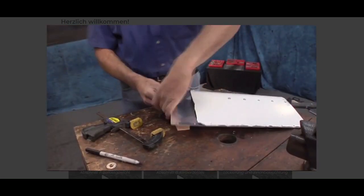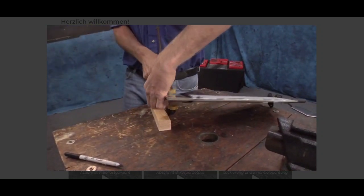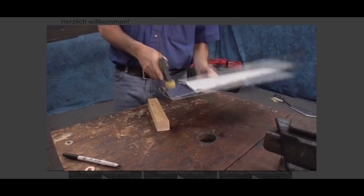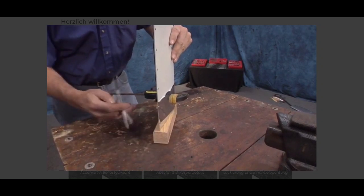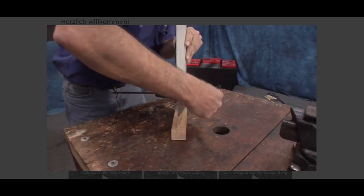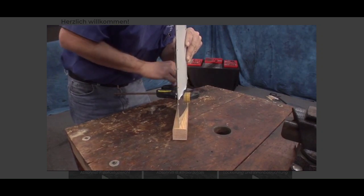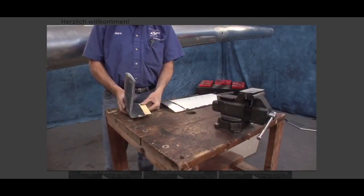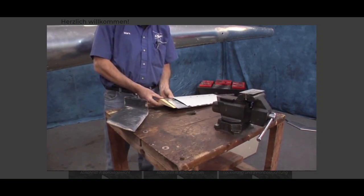Insert a short piece of 7/8 inch diameter tubing or use a socket that is 7/8 inches in outside diameter in the end of the airfoil. Note, the width of the end plugs should be the full thickness of the material, about 1 5/8 inches wide. The wood end plugs will be used to splice the winglets to the horizontal fins. Cut out and shape each end plug so that half fits into the fin and half fits into the winglet. You may have to trim or sand the winglet side for a better fit.